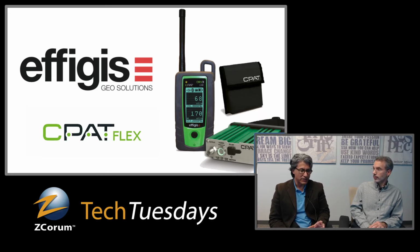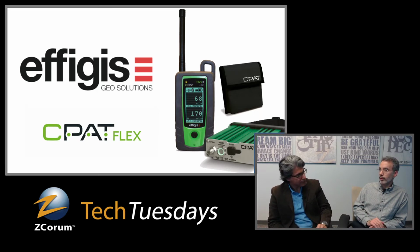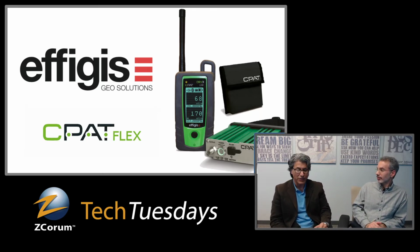So the idea is that the field tech will be able to coordinate with the end customer that this is going to occur, or if they know for a fact that the end customer is not at the house, they will do this type of activity and pressurize from the tap back into the house. And that's important because it could be customer affecting for a lot more than one customer if you go the wrong direction. Absolutely. Make sure you go toward the house. Yeah. What you're going to see in the video is connecting the pressurizer towards the house.